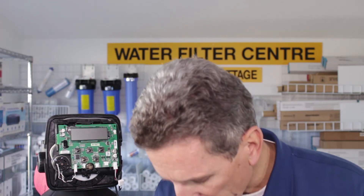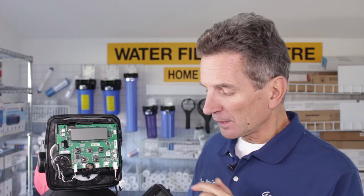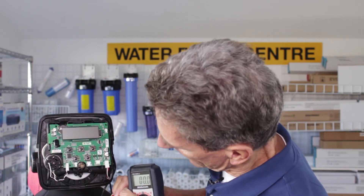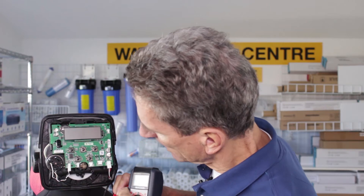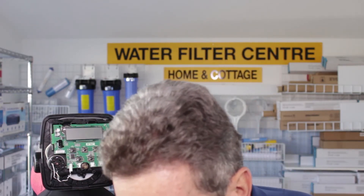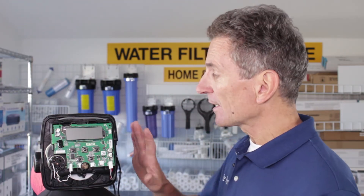Get a basic electrical voltage tester like this one here. One side you'll notice is a black wire, so you want to put the black lead — the common lead — to that side, and then put the red on the other side. As you can see, it's reading voltage: 15.9 volts. This is a low power circuit — it's not 110 volts. The transformer steps down the voltage, so that tells us the transformer is working.